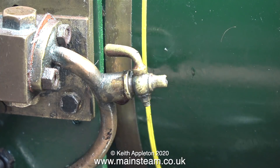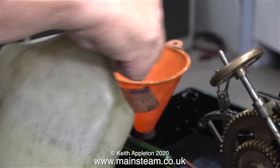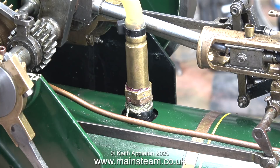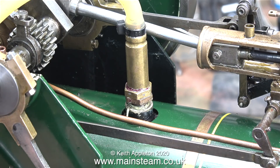Also, as usual, from the drain cock — this small drain cock is just used to bleed the system of air if ever you run out of water in the tank. It's time for a test. I'm now filling the water tank that I've refitted into the bunker — full of water. I've connected the airline, so it's time to turn on the compressed air. Note to self: before applying the compressed air, it's a really good idea to refit and seal the union nut that fastens the siphon to the turret.